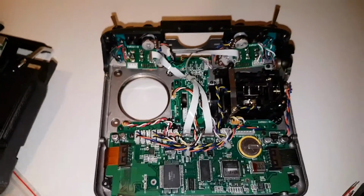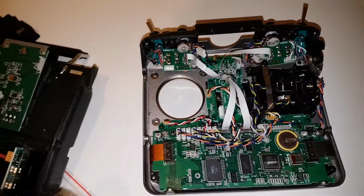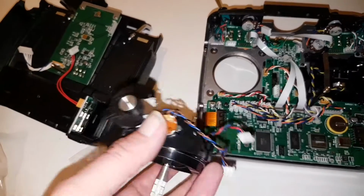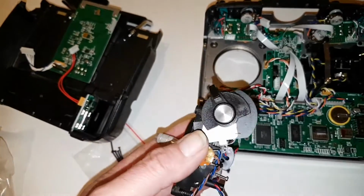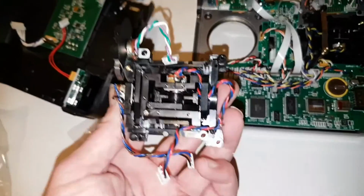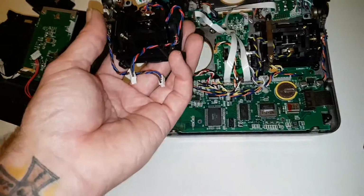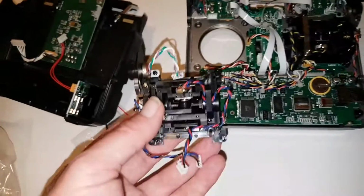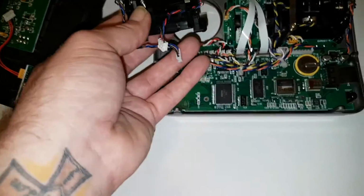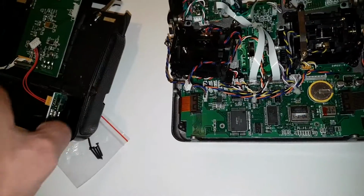Right, now that I've got the radio part, I've also pulled out the gimbal part. There's a little bit of modification here. You can see this gimbal here, it's got a slider attached to the gimbal itself, so we're going to have to modify that to put that back in there, as well as putting our single stick in. Now when the unit goes in there, you notice that the pots, one's right on the edge of the case and the other one shoots up.